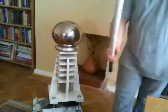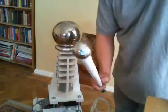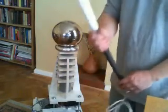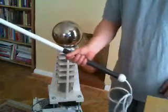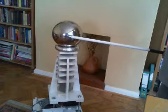The way you do it is by using this discharge rod. On the end is actually just a chrome door handle, which has been soldered to a length of cable. That cable has been passed up a length of plastic pipe, and I've put some rubber tape on the bottom to form a handle. It's about a meter long, so you're able to just touch that dome nice and safely to discharge it.